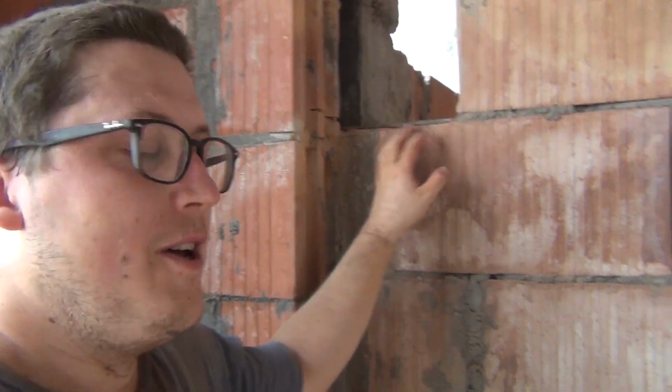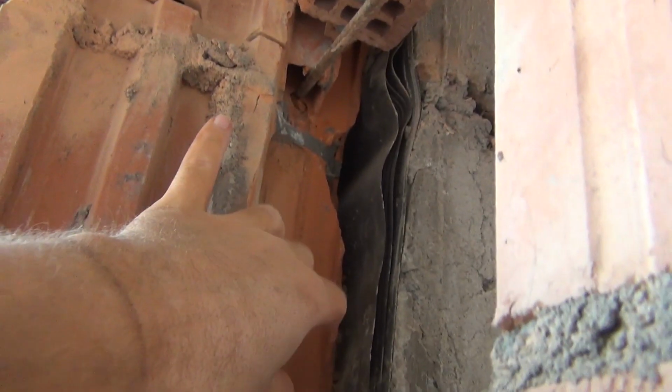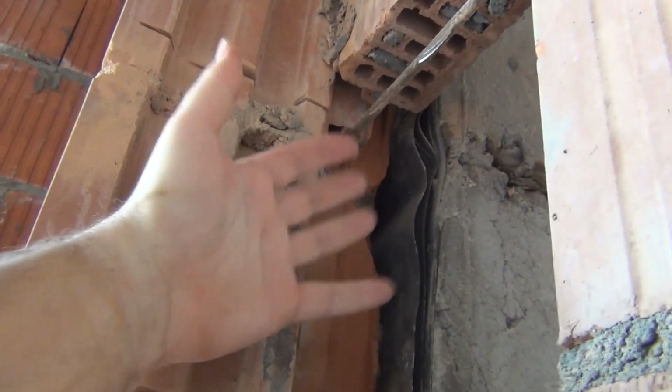So in the kitchen, we got these bricks out and those bricks out. Here you can see what we're aiming for. The brick is out and then we leave some room inside here so the replacement brick can slide in and provide support for the wall. Same thing here and up there. And that's how we're going to secure all of these walls.